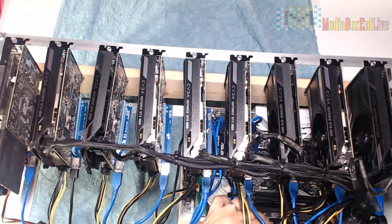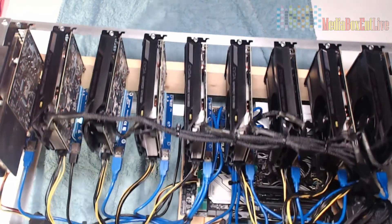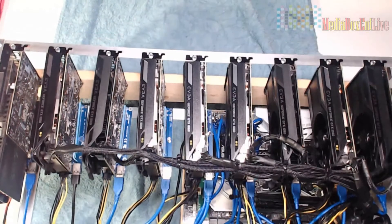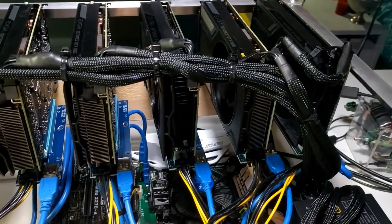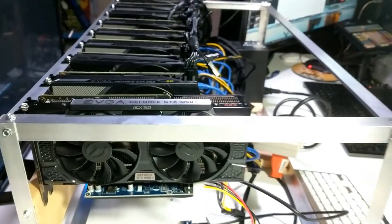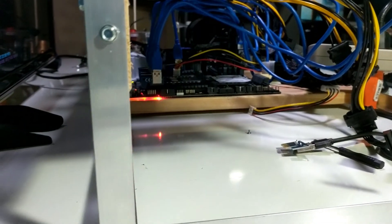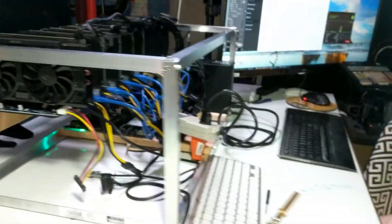We are about to finish - you'll see a nice video of how this thing looks in the end. This is the second part; the first video we built the rig frame, this one we put all the hardware together, and the third part will be the software setup - that video should be coming in about a week. It's actually running using 720 watts. I'll do a final video later after I get my replacement cards. You can see Simple Mining running and it looks pretty cool - I have one card unplugged right now doing some tests. If you have any questions or comments let me know, and I'll put all the information you need to build your mining rig for Bitcoin Gold, Ethereum, Monero, or any other coins. I'll see you next time!